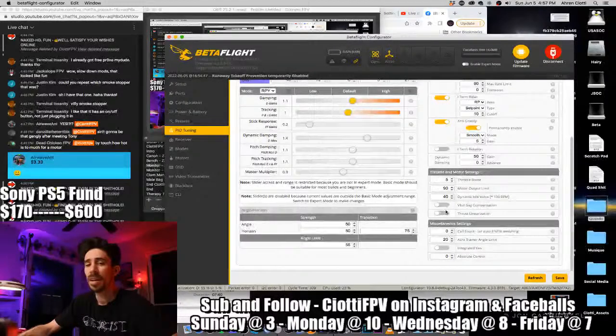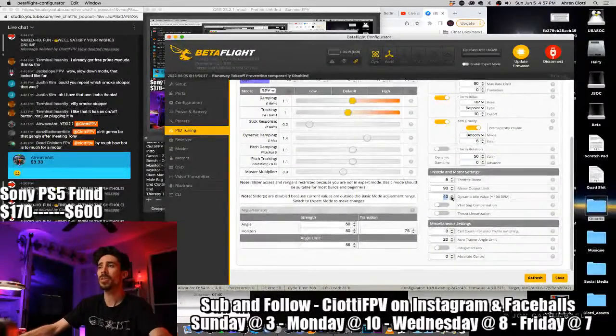What did I say, 40? I think I said 40. That's how you get your dynamic idle. That's like the OG way of getting it. If you then want to chase the dragon, this is a very safe number to put in here. If you put this thing up in the air and it doesn't desync, you can start to lower this value. You can lower this value all the way down until it starts to desync when you put it into prop wash, when you really rail on the rig. And then you can just raise it up a little bit more. That's how you get your dynamic idle as low as possible. I've had pretty good luck just using that little thing that I just did, and it seems to work incredibly well.